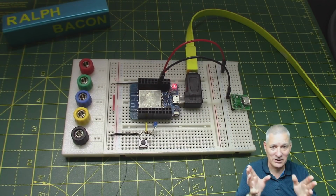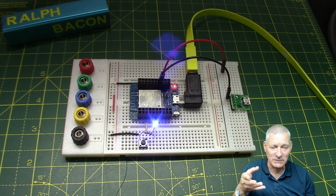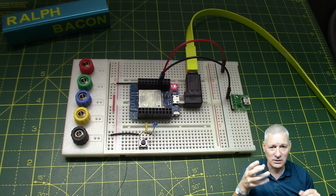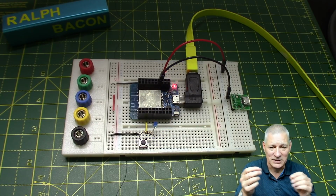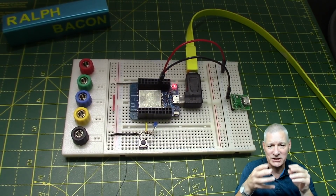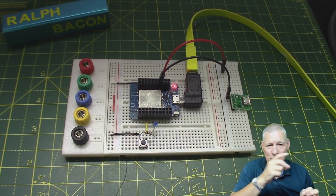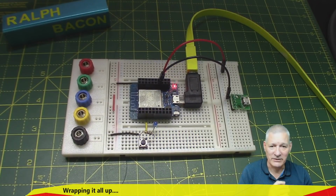And it works absolutely great. The actual device that I'm using is very, very similar to this. It's not the same shape or anything, but it's similar. And it takes overall 3 milliamps when it's in deep sleep mode, which isn't great. I mean, it should be down to sort of half a milliamp or 150 microamps. But then, of course, remember, we are powering the entire board up as far as it needs to be powered up, which includes, I guess, other components, and there might be resistor network dividers and things, all of which take a little bit of power. Yeah, no LEDs though, thank goodness. And it works fine. I've got a little battery, and I'll show you all that in due course when I do my smart heater controller video. So ESP32 deep sleep, I think, is the way to go.